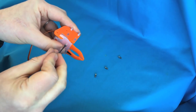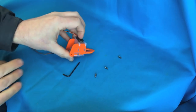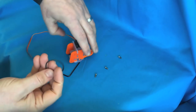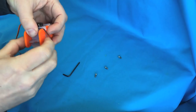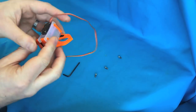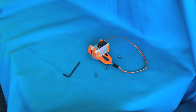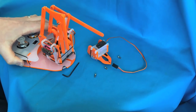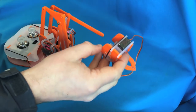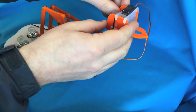Don't do it too tight, because otherwise the grab won't open — it should move nice and freely. Take the final elastic band and pop it around the top to keep it nice and tight; it should align with the little grooves on the sides. Then take the rest of the body made earlier and attach the grab to the struts using the remaining 6mm screws.